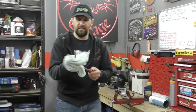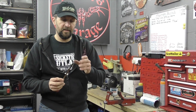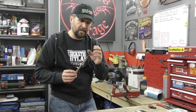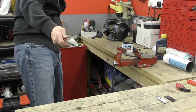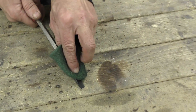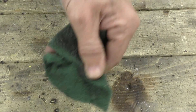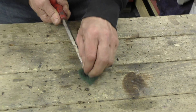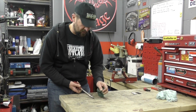That's as simple as that. If you want to repair an old tool, that's a way to do it. It's simply following the last video on oil burning, but this is quenching from red hot to stone cold in oil — that makes the metal hard, durable, and resilient. There we are — repaired screwdriver. The process will make it black because the oil burns in, but you can buff that out with a Scotch-Brite and make it shiny again. I've done that to this screwdriver a dozen times.